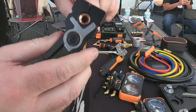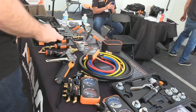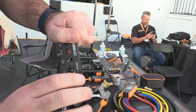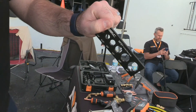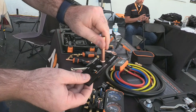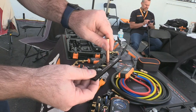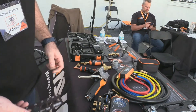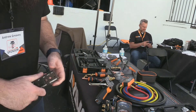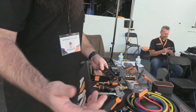We get ourselves a very consistent, repeatable 45-degree flare. That can then sit inside and seat right on our flare gauge, which has a little machined lip. A perfect flare will pass into that hole but catch that lip before it passes through — so that's a good, quick indicator that you've got the correct flare. If you follow that up with maintaining your manufacturer's torque specs, you're going to really minimize those callbacks or issues after commissioning and startup with that VRF or mini-split.